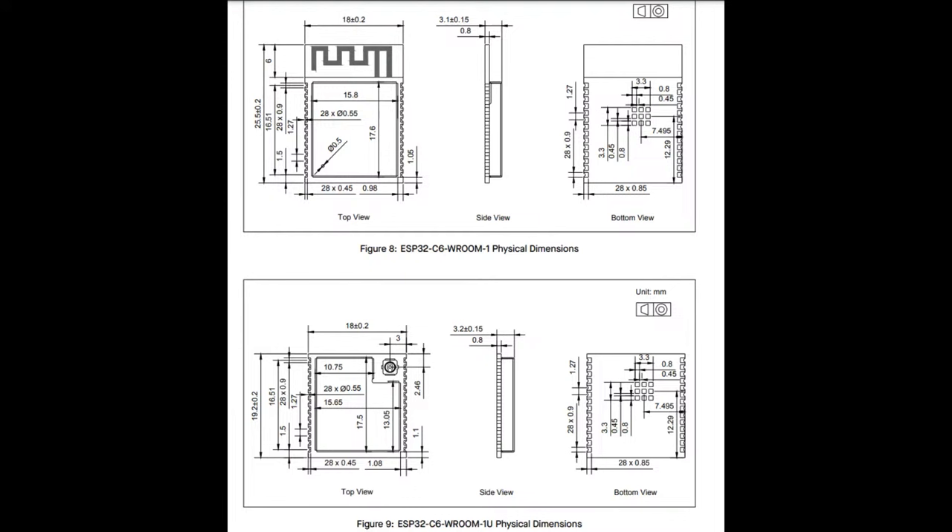Someone wants to know: have any microcontrollers adopted 5 GHz yet? With moving to 5 GHz, you're going to have to redo all of your analog front end. Espressif really nailed down their Wi-Fi setup — someone once did a decapping and analyzed the layout of their output stage and said it was an amazingly engineered Wi-Fi antenna front end. Once you've figured that out, you don't want to mess with it. I think they will come out with 5 GHz eventually — Nordic has a 5 GHz Wi-Fi module — but we're going to still see a lot of 2.4 GHz for the next couple of years.